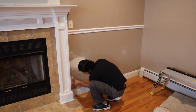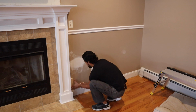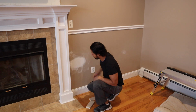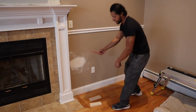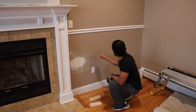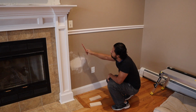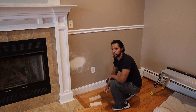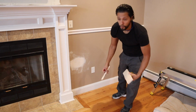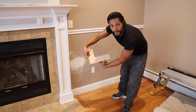Go off the baseboard. This point of reference is going to give me my length from top to bottom. So if we're going to have 3 boxes, we're going to need 2 long panel moldings on each box, so that's 6, and we'll also need to cut 6 for the width of the same panel molding. So now we can set up a stop block, cut everything in one shot, come back and nail it up picture frame style using these blocks as our right angle gauge.